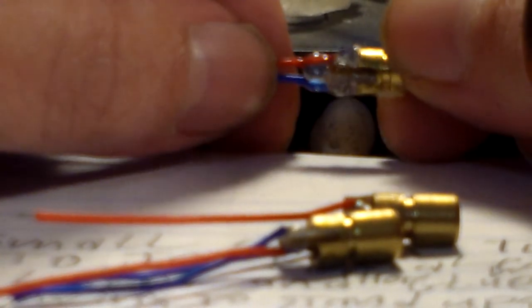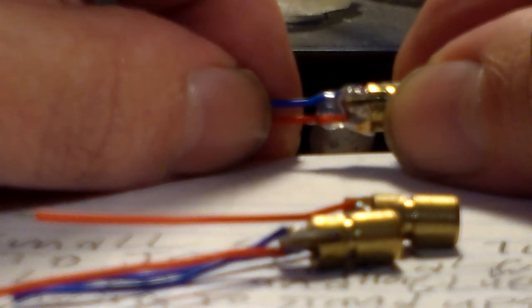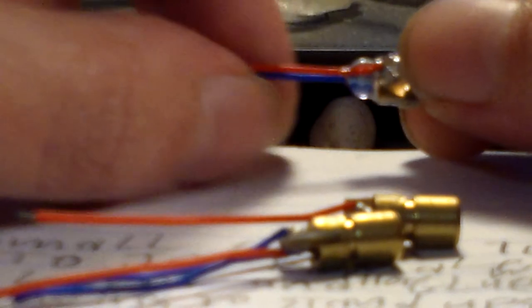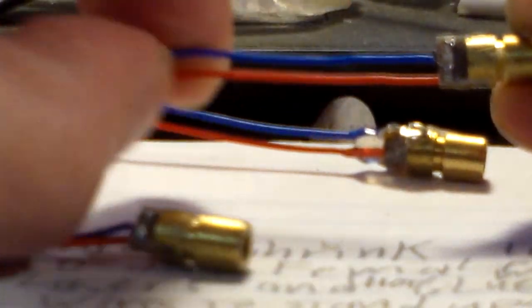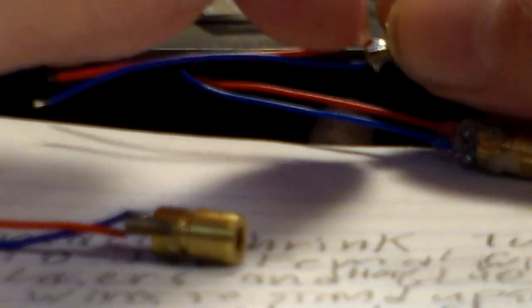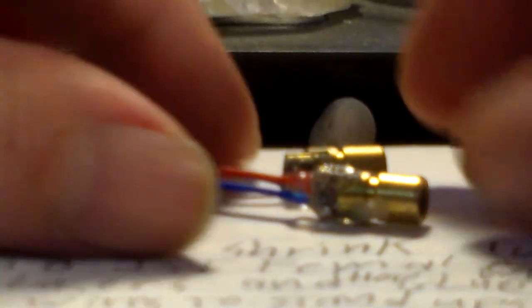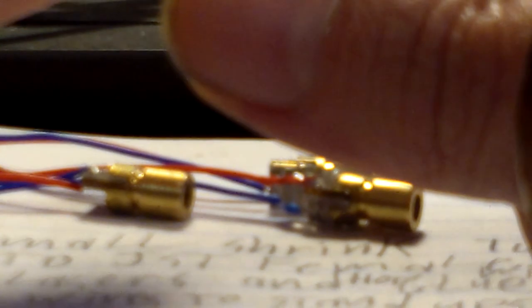We're getting really close to being done. I think in video 10 we could probably finish up the whole project. Make sure your wires are straight — these aren't very straight so we've got to straighten them out. Then we're going to glue the PC board so it doesn't connect to anything and also to give a little strength to the wires, which already feel like they're getting ready to fall off. In the next video we're going to put some heat shrink tubing on, strip some wires, solder some stuff, and then we're done. See you in the next video!